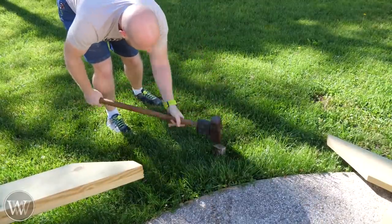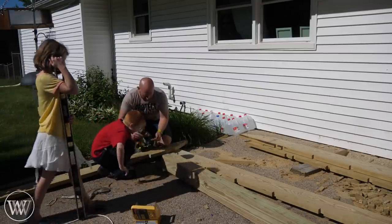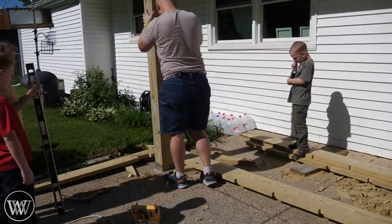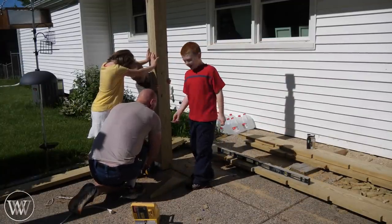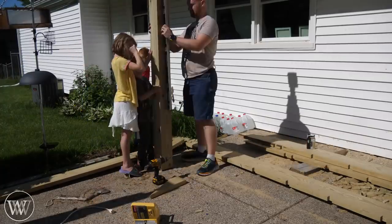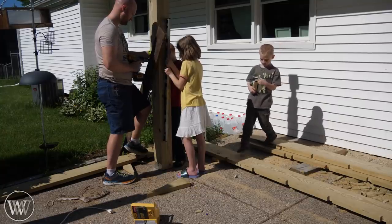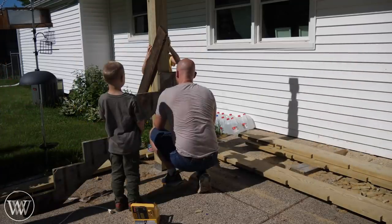I also got some post bases held down with ramset nails driven into the concrete. A couple of the nails were sticking up a little too high, so I had to drill out the bottom of the post so the nail would house up into the beam. The brackets put screws in from the sides to keep it from sliding, but for vertical stability we need diagonal bracing. The kids were very useful here — some of them would give me screws, some would hold things, and it was nice to bring them in and show them something different. We put in a few braces and got these 6x6s standing up.